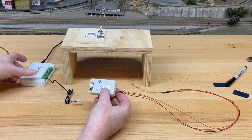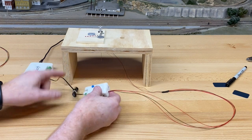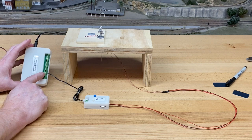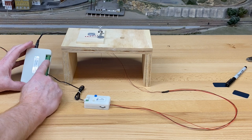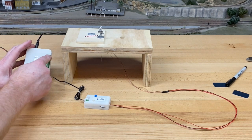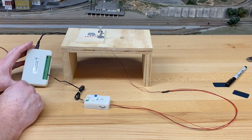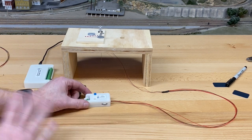So the next thing is all of the gate controllers come with this plug in the wire. It's 24 inches long. I'm using the power module, and you can plug these wires any which way as long as they're on two adjacent terminals. Essentially, it goes plus, minus, plus, minus, plus, minus, all the way across here. We didn't label them because any two adjacent wires will work, and the polarity for the gate controller doesn't matter, okay?